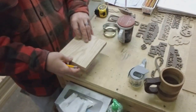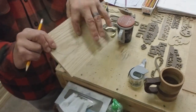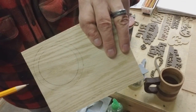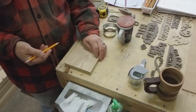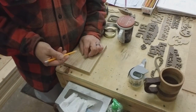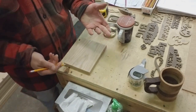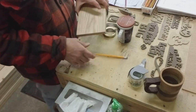You're going to cut the inside out, and it's a perfect ring, and it's about 1/4 inch, which after all the sanding ends up being about the wall of the mug. It's going to be about 3/16 thick, which is about perfect for drinking. I think even the ceramic mugs or glasses you buy are a little thinner than that, but for wood ones it's a little better to be a little thicker. They're more durable. So there's that.